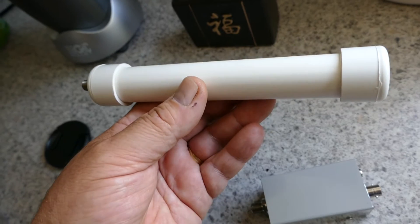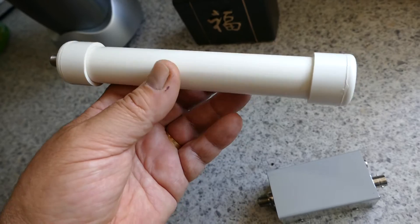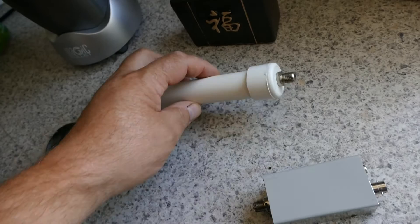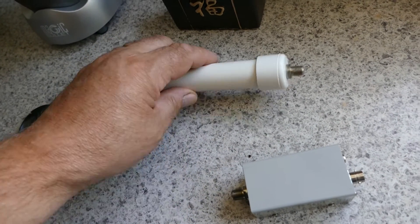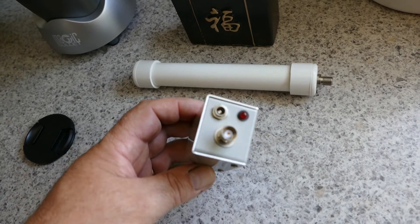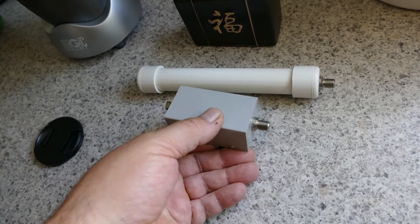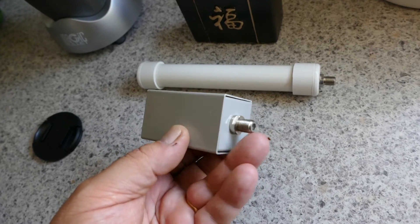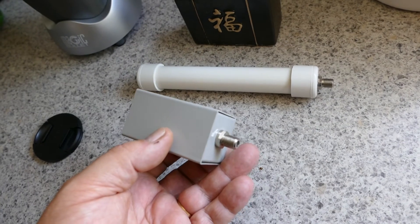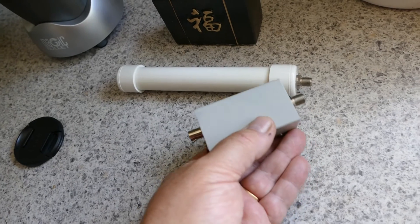It really is designed and I would only recommend it for use on VLF. You can also use it on medium wave for DXing — it's very, very sensitive. That antenna needs 12 volts to operate, and the 12 volts for the antenna is actually supplied by this power injector which comes with the antenna. There's an F-connector there as well, so the coaxial cable — your long run of coax from near the receiver to the antenna — actually connects between here and that point there.